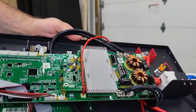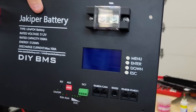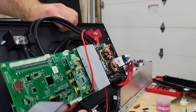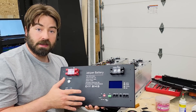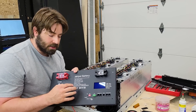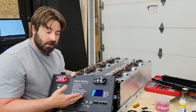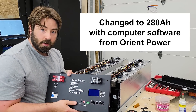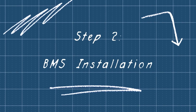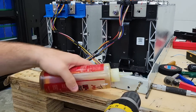Orient Power sells a lot of batteries and I've tested some of their batteries in the past — they all worked great. I asked them if they could sell this front panel with the terminals, circuit breaker, on/off switch, screen, and the really nice BMS on the backside, and they agreed. If you're interested, I have a separate link and discount code for this BMS in the description below. The front label says it's 100 amp hours — that's how it's factory configured. You can use it straight out of the box, but the state of charge reading on the front display won't be accurate until you change that parameter with software.